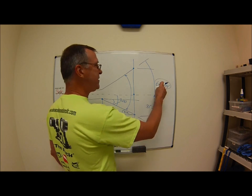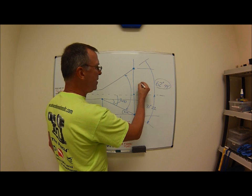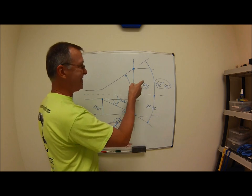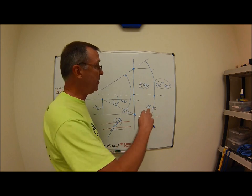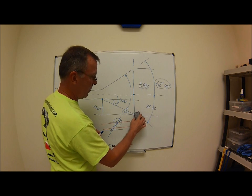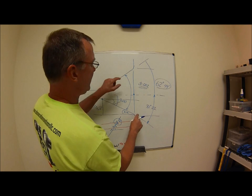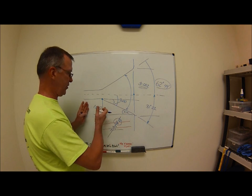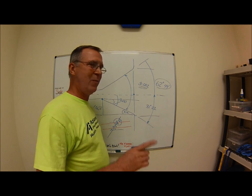That engineer was not only satisfied putting an impossible angle on this for you to cut, but he also put a dimension from here to here — plus or minus two thousandths of an inch. I'm going to show you in the next video exactly how to measure that, because a lot of people will put their calipers across the face and look at it with a loupe and pray the planets lined up. Let's go one step beyond: let's say you're the inspector and the guy that cut that angle broke the corner — he put a small 45 on it because it was sharp — so that point doesn't exist anymore, but you still have a plus-or-minus-two dimension and a critical angle. Let's go out in the shop.